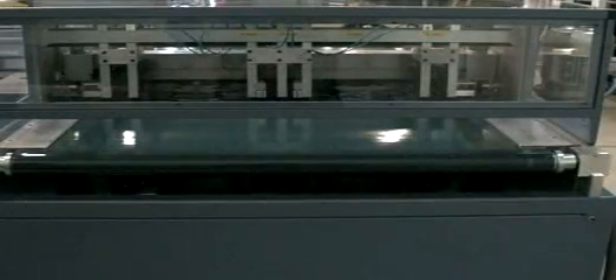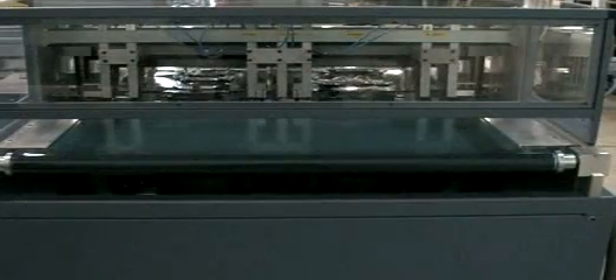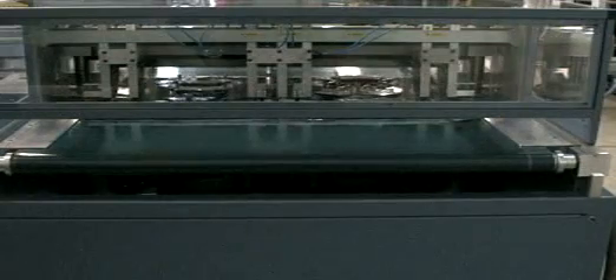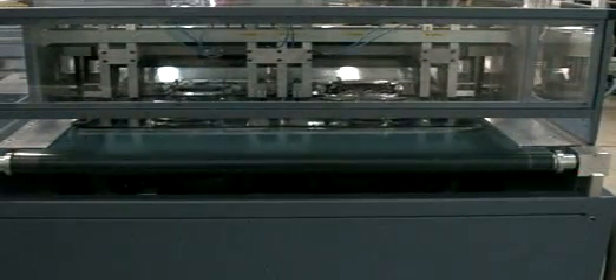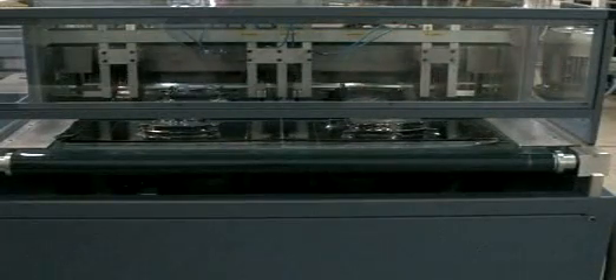Starview's SDC Series slitting and die-cutting machines can be provided with additional slitting heads for straight or perforated cutting, as well as longer-than-standard infeed and outfeed conveyors. Finished skin packages and trimmed scrap are discharged from the machine by a powered conveyor.